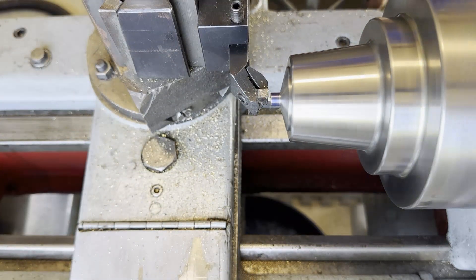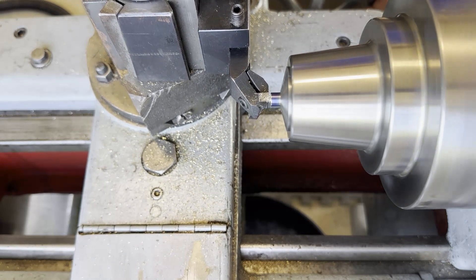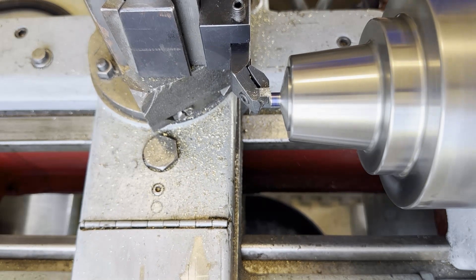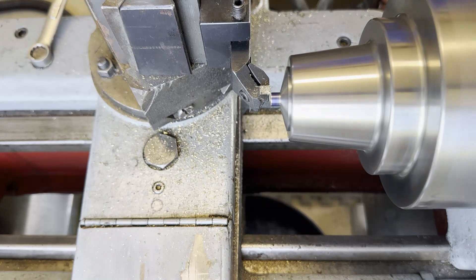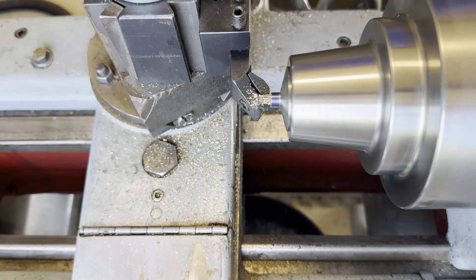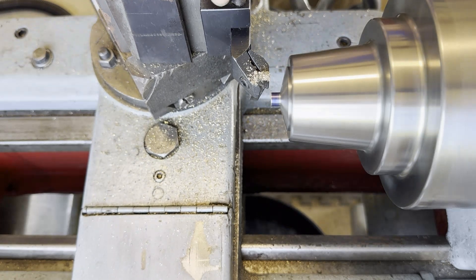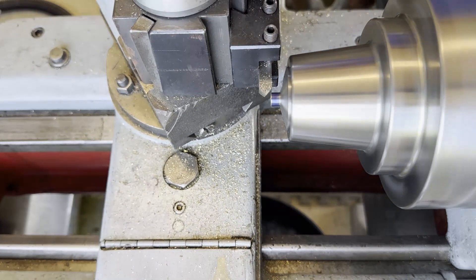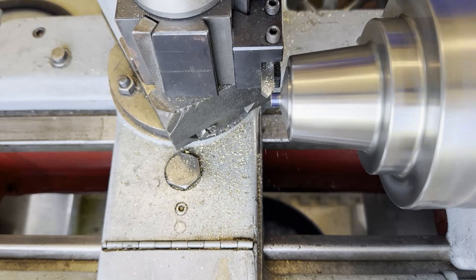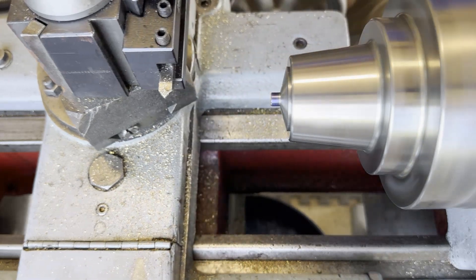I got that part off, and then I spun the piece around in my collet so that I could clean up the end where I parted it off. I'm just going to square this up by facing it off. You can see me lock my lathe down again and run the cross slide over to put a little chamfer on this end. This is going to just about finish up our barrel.